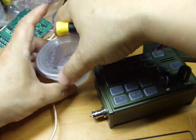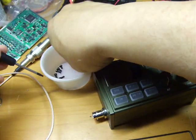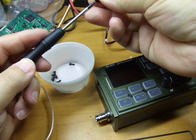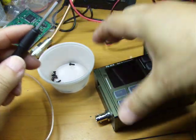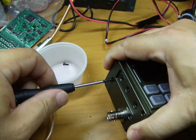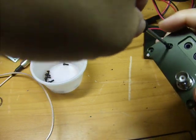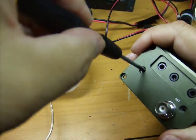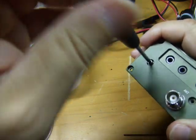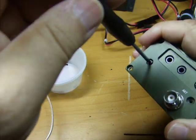Understand that you've got limited space inside. And again, remember that the final transistors in this radio don't have a huge amount of heat sinking going on. So, as much as you may be tempted to run this thing full tilt, unless you want to totally brick your $500 — $550 USD — radio when purchased directly from BG2FX, you might want to have this thing last a little bit longer.